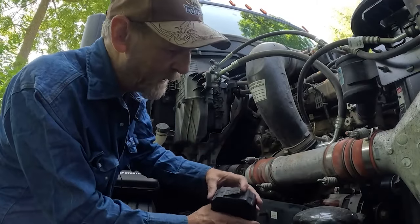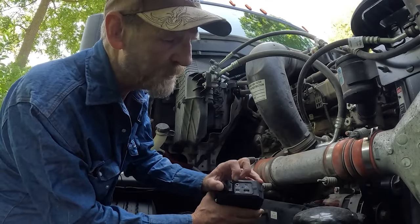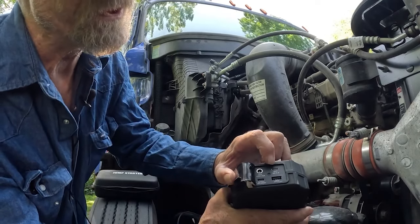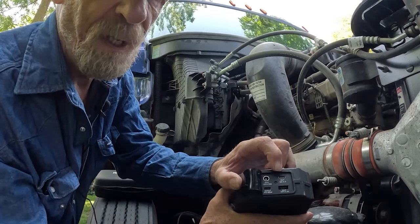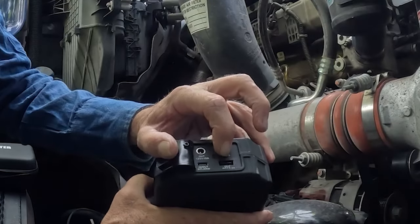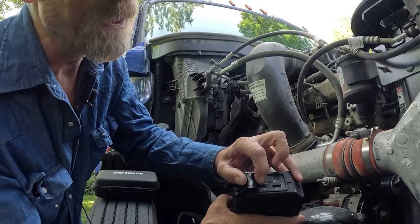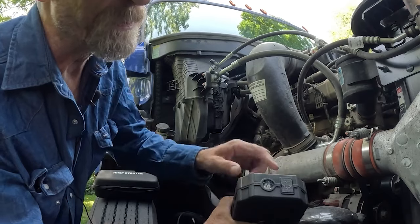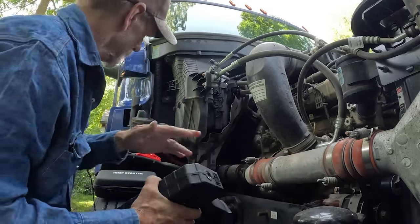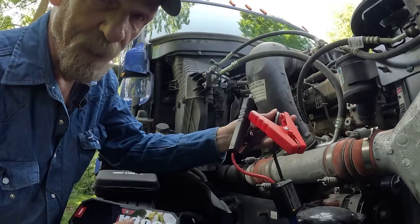But not only that, on the end here, in this little flap, you have a 12 volt DC 10 amp out. You also have a QC 3.0 USB-C out, which is 18 watts. You've also got a 5 volt 4 amp out USB-A, and you have a 65 watt PD outbound. Of course, this side here, that's where you plug in your adapter. Jumpstart your cabling, or your cabling to jumpstart your battery.